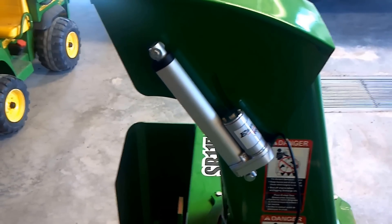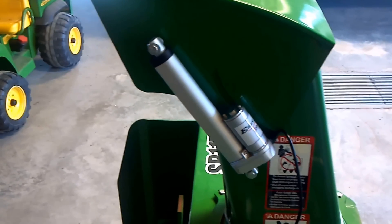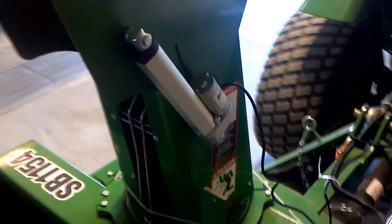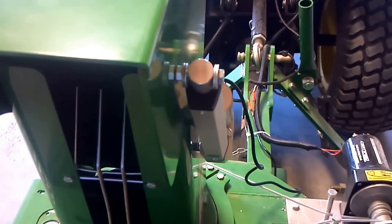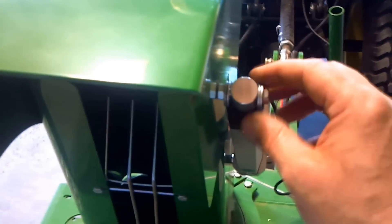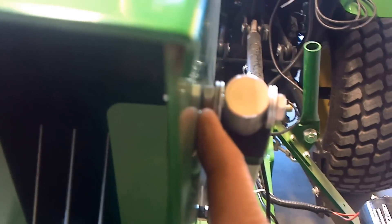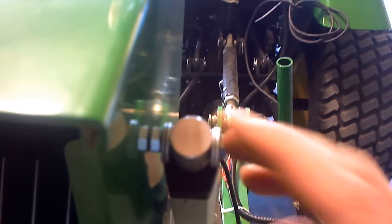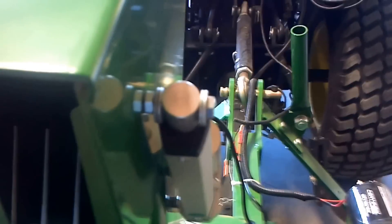I got a 6 inch linear actuator and installed it. What I did was I put some bolts — I don't know if you can see inside there. This nut here has got the plastic in it, one of those lock nuts. It holds on there pretty tight. Got another nut there, some washers, some more washers. The trick to this is you have to leave this loose because it needs to move back and forth.